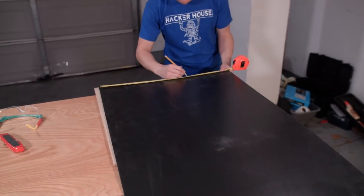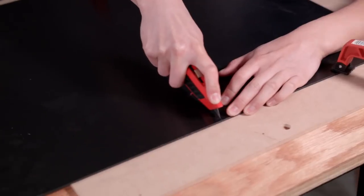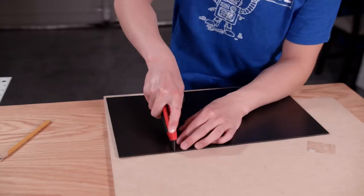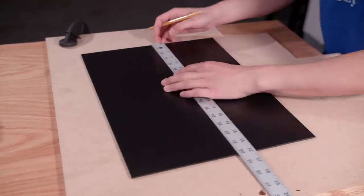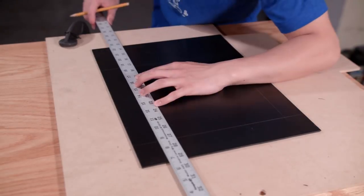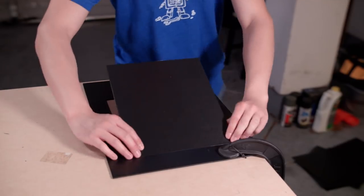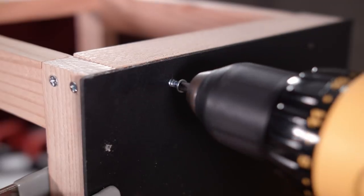To make the bartender look nice, we used some PVC project board to make side panels. It's really easy to mark up and then cut with a box cutter. There are too many sizes to list here, so I'll throw those on the screen. We cut an access panel out of the side piece to slide the electronics panel in, then made a cutout in the front panel — 8.5 inches by 10 inches — lined up with the top of the drink platform. Using some more screws, we screwed the side panels in place. Make sure you don't screw these too tight because they'll warp the plastic.